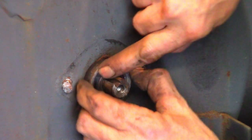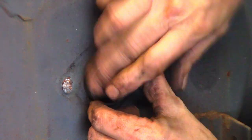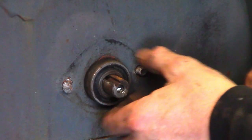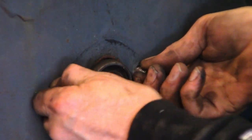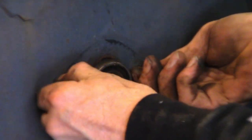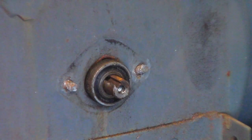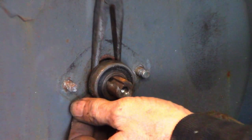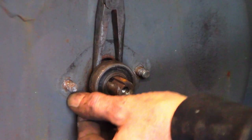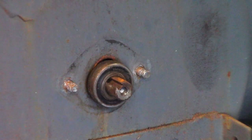The bearing is not actually bad. What kind of bearing is that? 6203. I would change it if it needed it, but it doesn't need it. These are just spinning. I think we have to get the impeller off, which means we'll have to pull this bearing. Just hoping it'll come free easily - doesn't look like it. It's got some penetrating oil on it. Snowblowers get uniquely rusty, because once you blow the end of your driveway where the snowplow's been, there's all kinds of salt out there.